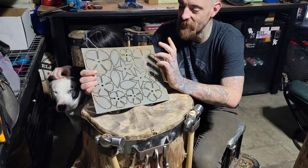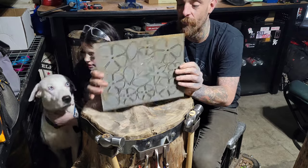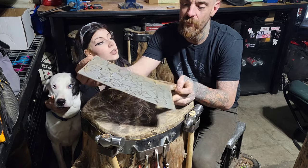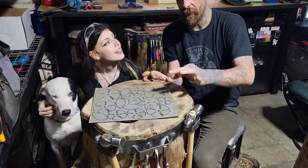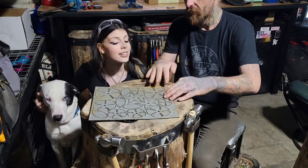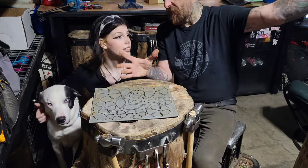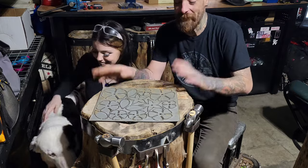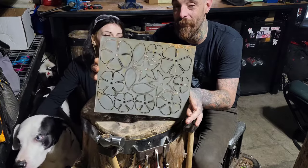Originally I used to cut these as individual pieces on the plasma table — they'd fall through, make a mess, be covered in slag, horrible to clean up. These are actually pretty minimal. If I had a tumbler it'd be so much easier. A tumbler is like a drum that rotates with little paddles inside, and you put abrasive cubes or pyramid shapes in there. When it tumbles, all the grit sands it down and gives it a uniform finish — like a rock tumbler but bigger.